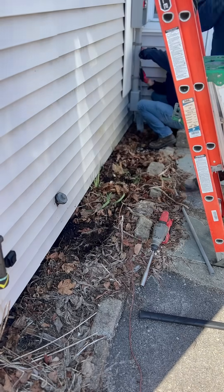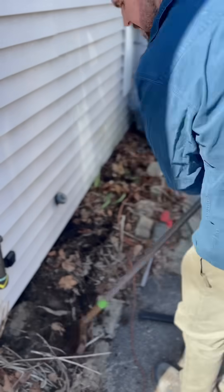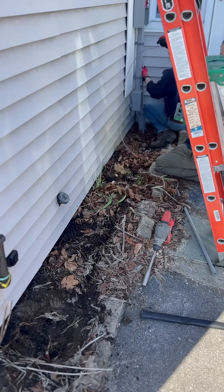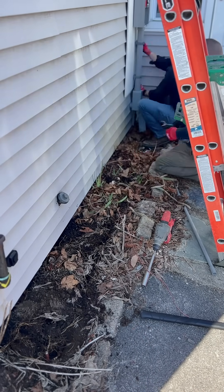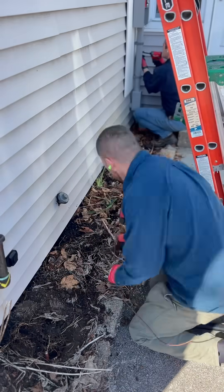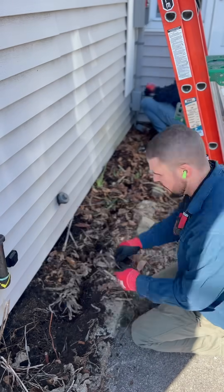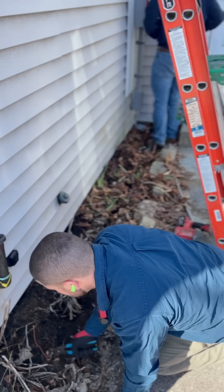Here I am going at least six to eight inches down for the grounding electrode cable connecting the two rods. It's easy to push it into this dirt — I pushed it all the way down very easily. I didn't want to ruin the garden as it had some live plants in there, so I made a nice little slit and pushed it back down really easily so we didn't disturb it too much.